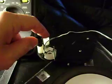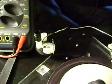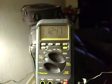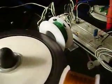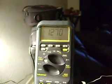I don't have this reed switch in position yet, close enough to activate. There's also a diametric magnet here that I can turn, and it polarizes the reed switch to only activate on either the north or the south depending on which way you do it. If you fine-tune this, you can get the switching down to really fine pulses or long pulses or opposite pulses. We're up to 1.25 volts — she's just about at the highest speed she's going to get.